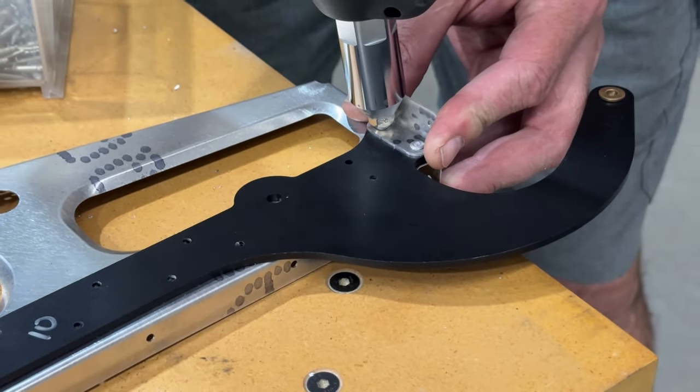I can do the proper hardware back here now. I'm noticing a gap — probably around 150 thousandths, between 1/8th and 3/16ths. The manual does call for some washer stack-ups in there — a couple thick and a thin — which does seem to come to about that dimension. I did post a question on the Facebook S21 Builders group just to verify that anyone else at this stage had a similar sized gap.